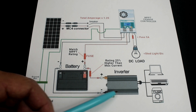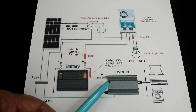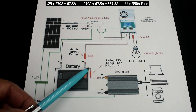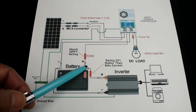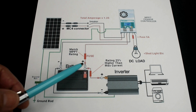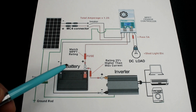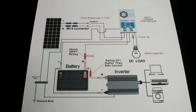Sizing the inverter fuse is simple: figure out how much current the power inverter uses. If you're using a 3,000-watt unit, it's going to pull around 270 amps — take that 270 and make it 25% higher. Make sure you're using the correct wire size to handle the current. With a 300-amp draw, you could use two number-one stranded copper wires in parallel, or one larger wire like a 4-ought stranded copper wire. The higher the system voltage — 24V or 36V — the wires will be smaller because there's less current flowing, and fuse ratings will also be less. Make sure the solar panel, rack, and frame are all connected together.